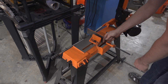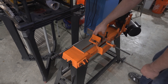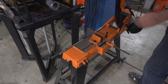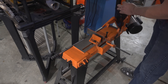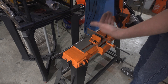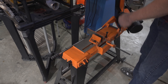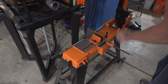This saw has a little stop piece so if you want to do the exact same cut repeatedly, you just butt the stock up against it and you don't have to keep measuring. Another reason it's nice compared to a chop saw is the width of the blade — you won't get any thinner than a bandsaw blade for cutting. A chop saw's abrasive blade is probably four times as thick, so you're going to lose a lot more material with that.